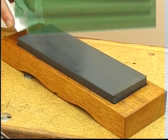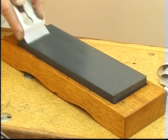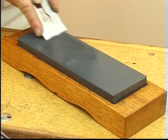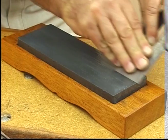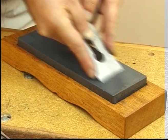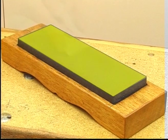Different books recommend different sharpening patterns or techniques. These can be a simple backwards and forward stroke, a circular motion, or a figure-8 action. To limit any rocking motion, a useful technique is to hold the blade side on. The overriding consideration, however, is to ensure that wear is spread evenly over the entire surface of the stone to maintain it as a flat and effective sharpening tool.